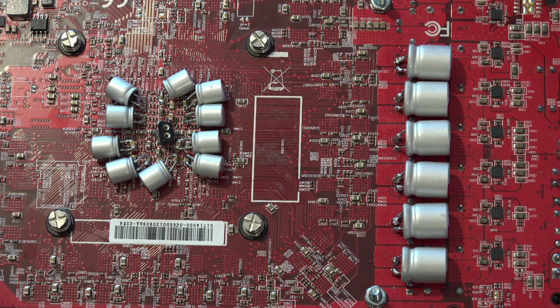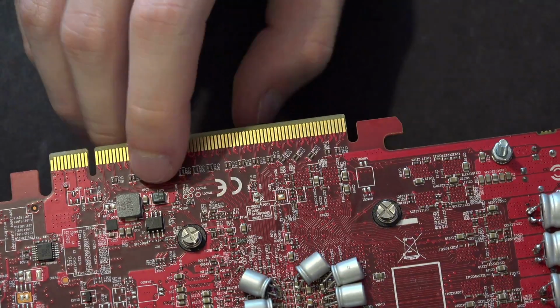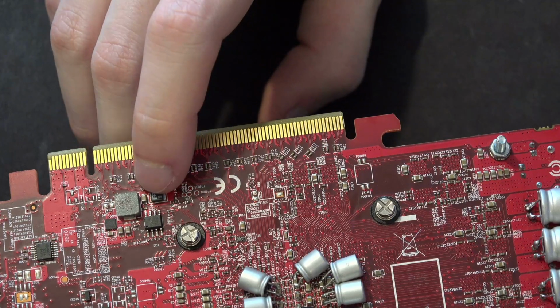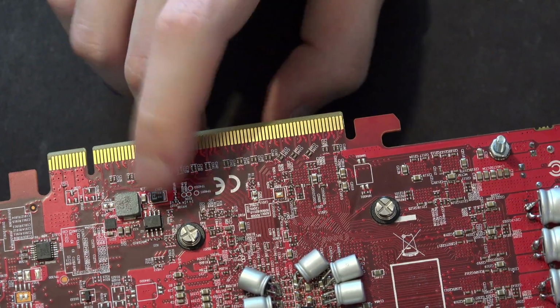And the 0805s should work at higher frequency ranges than any kind of through-hole capacitor that you can get your hands on. Admittedly, they do make some very low ESL, very low ESR SMD aluminum polymers, aluminum tantalum, and tantalum polymers, but those are insanely expensive. Panasonic has a capacitor series called, I think, the TPSF, and they make a 220 microfarad capacitor. It's tiny. I think it's this package right here. It's in this package size, and it's like 6 milliohm ESR and 0.7 nanohenry ESL.